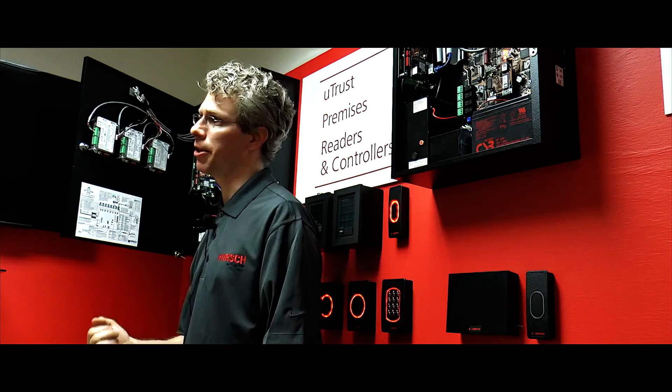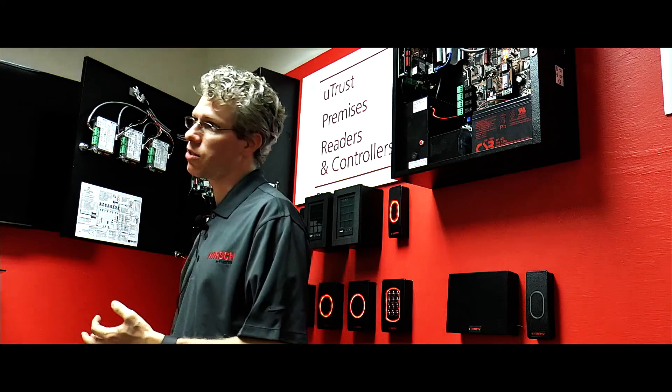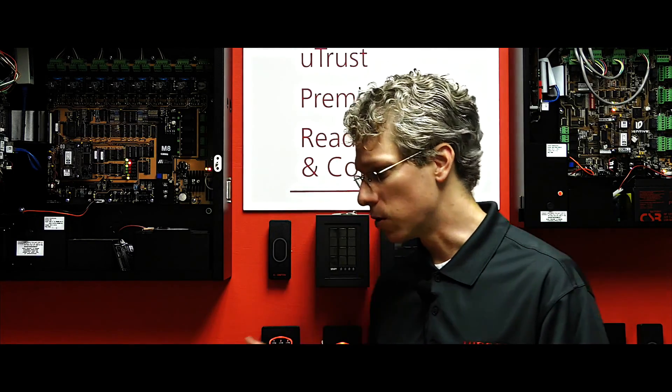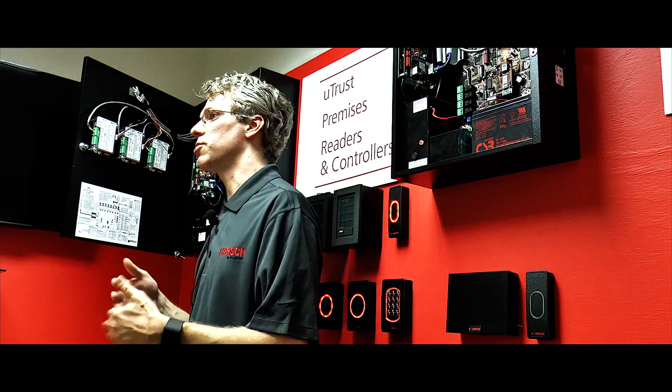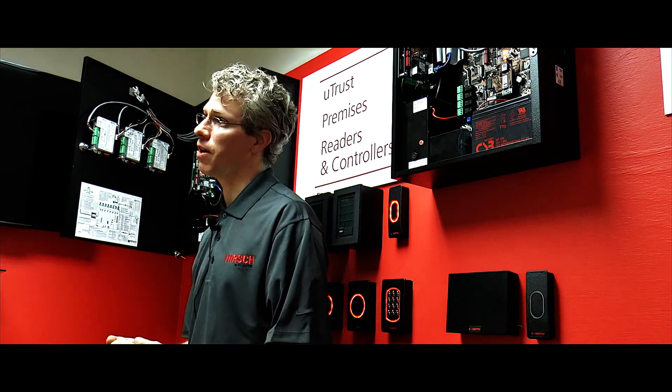The RREB allows two-way communication between the reader and the SNIB 3 — the controller essentially — so that we're doing bi-directional communication, which is what's required for FICAM. This means being able to do card crypto checks, hash checks, to validate the certificate is still valid, going back to the CRL, OCSP, SCVP, CVP, or anywhere in your validation infrastructure. The reader is going to talk to the SNIB 3 directly to do a cert check: is this cert still valid, is it showing up on a CRL? The controller itself is still doing authorization — are you allowed to come through this door? So we're hitting both authentication and authorization, all within a very short period of time.